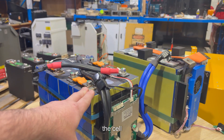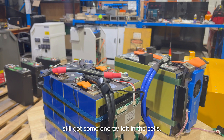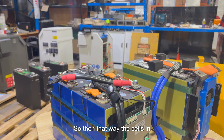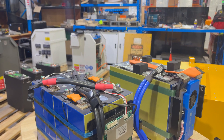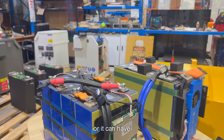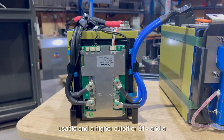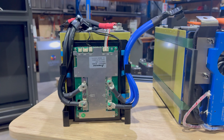The cell low voltage cutoff is raised on one model, so if it's sent completely flat — say in a motor vehicle or caravan — it's not actually completely flat. That way, cells won't be damaged by self-discharge if left for a month or two. The cutoff can be either 10 volt or 11.8 volt depending on customer choice — essentially 300 amp hours usable with a higher cutoff, or 314 with a lower cutoff.